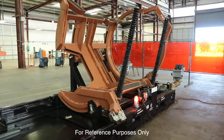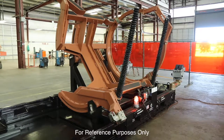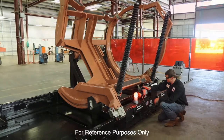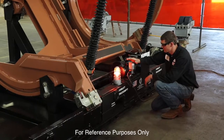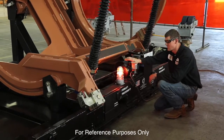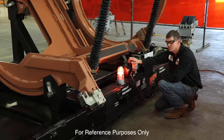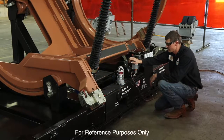At this time we have the power source for the motor plugged in. Please note you need a 20-amp breaker. At this time we're going to go ahead and roll. The critical part on the handle here — which is minor to some — does affect this breaker. That motor will start to engage if you only partially push the lever. You must fully engage it.